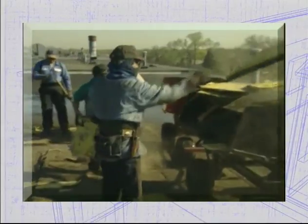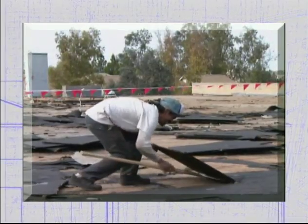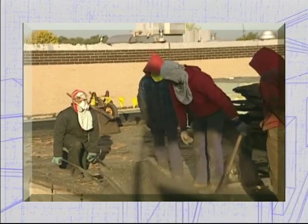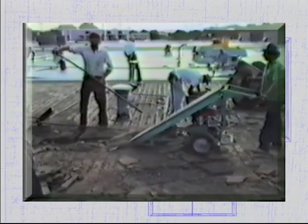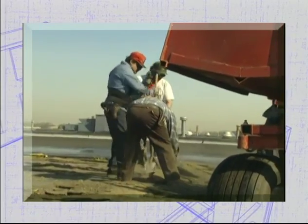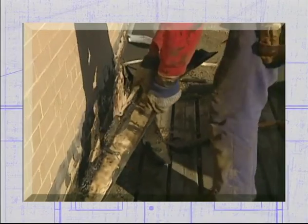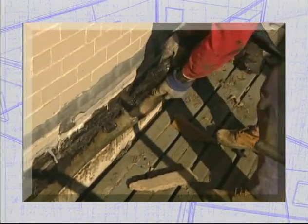Follow safe lifting techniques when removing the old roof system, or utilize one of the many tools designed to help with this task to reduce fatigue and maximize your effort. Never force stubborn materials. Chop them apart, and don't forget you may need the power tear-off machine. Remember that a tear-off includes all of the field and usually most of the flashings. But check with your supervisor if any components, like metal copings or scuppers, need to be saved before tearing them